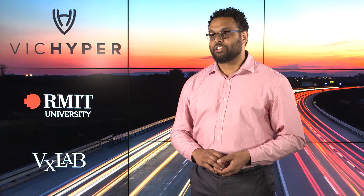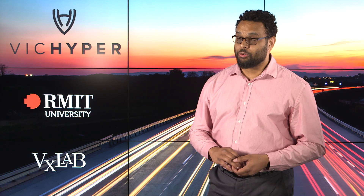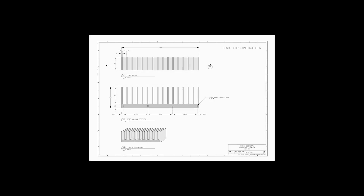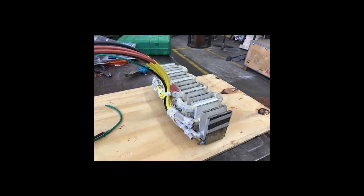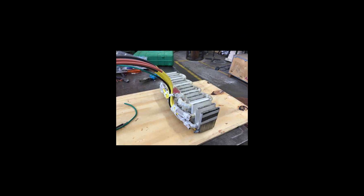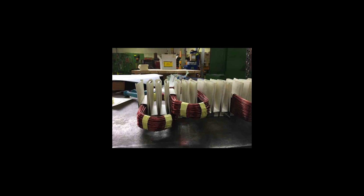The dimensions of the linear induction motor are approximately 350 millimetres long by 200 millimetres wide by about 100 millimetres deep. The linear induction motor geometry is broken up into two main parts: the first is a steel core constructed of multiple layers of electric steel sandwiched together, and the second is a series of coils wound together with copper wire and wrapped over the core motor.